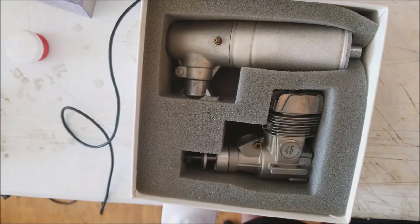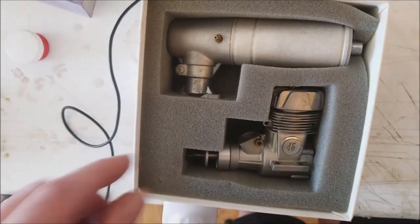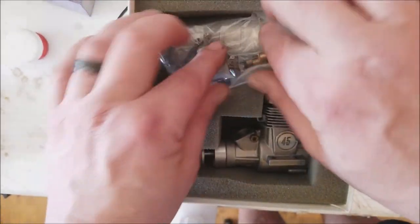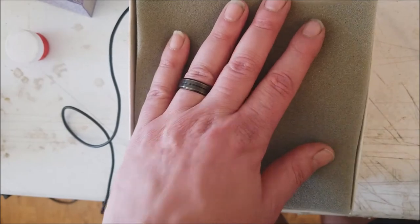So our next step here, after the epoxy cures on the tail feathers of the Avistar, we're going to fit our motor crankcase to our Avistar, because if I remember correctly, it wasn't an exact fit, so we'll have to do a little bit of carving and some more epoxy work before we actually set the motor.